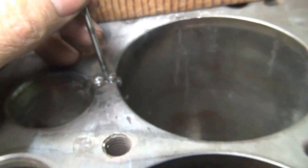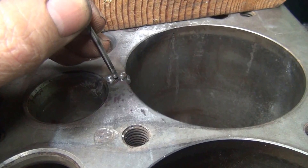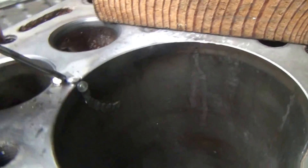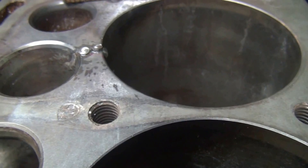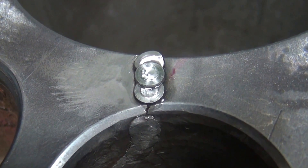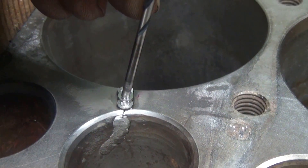I am going to put another one in here right between these. Pull it out a little bit so we can see what is going on. I think I am going to put the angle in kind of about the same angle this other one was in — a little bit off the side, but right down the center between the two, at an angle. So it should go about 50% through the one I just put in, barely hit this one, and finish up the rest of that crack in the block. I have to grind these away and drill a hole. I got the third pin in there — I basically just duplicated the angle of the old one. It went in like this and then at a pretty heavy angle, and it pretty much just cut the other one right in half.